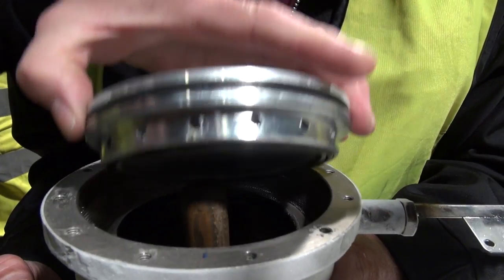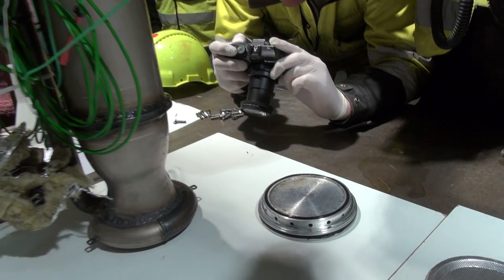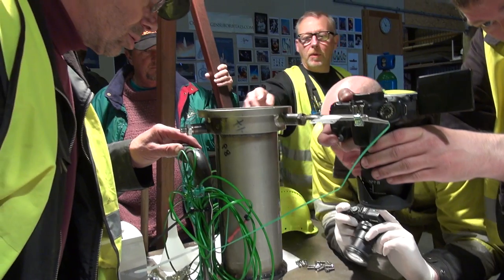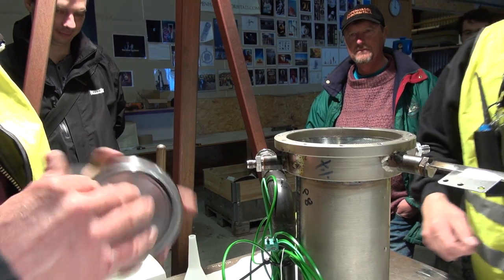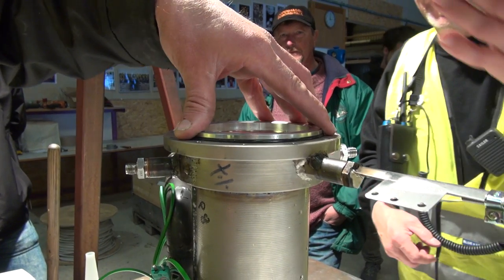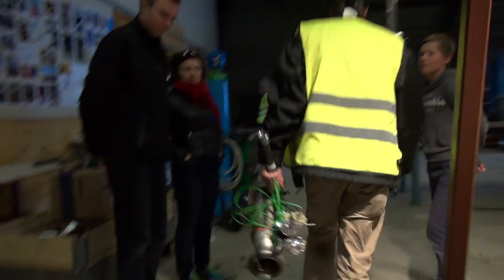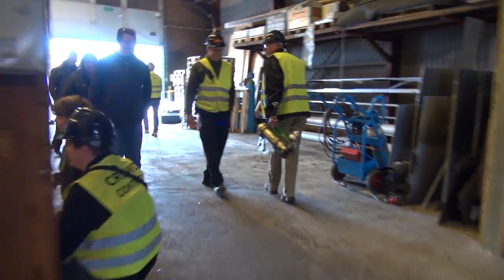And this time on the fuel side, we have tried automating that process so that we can simply enter a target pressure on a screen, and there's a control system to control the helium flow and build up the desired pressure. So that ran for the first time, and the good news was it worked. There wasn't any significant overshoot on the control system. It had good accuracy.